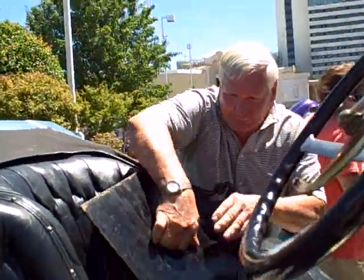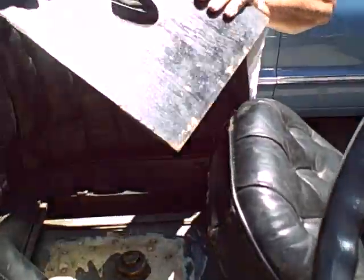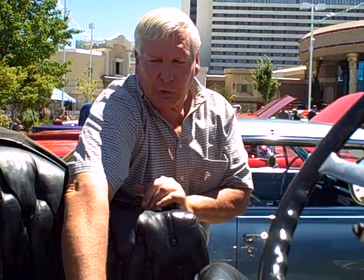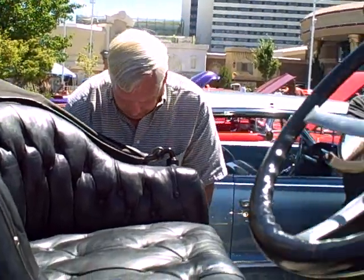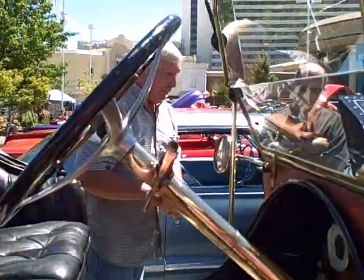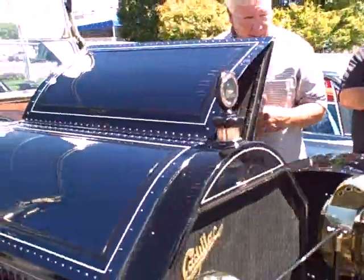You've got to have the gas on, and it runs. It's dual ignition — there's two sets of spark plugs. That's the only change I made. One of them, you start it on coil because it's a hotter spark, and as soon as it's running you flip it to mag. But I rigged it so it's firing both spark plugs at once, and I'm really lighting up the cylinders big time. I use a glove because the little wood thing pinches me.